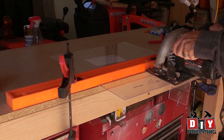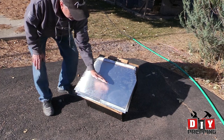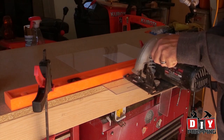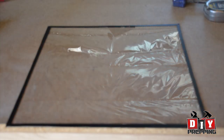With the plexiglass, cut it to 16 and a half inches by 16 inches, because this level where it goes down is going to be a little bit longer than the sides. Make sure you have that extra half inch. Cut it real slow and it's not going to crack or break. Like I said, I switched this out to glass - it's up to you. On the outside, I put some electrical tape on there to seal those edges and sharp edges and make it look a little bit better. With the glass I switched to, I did the same thing.